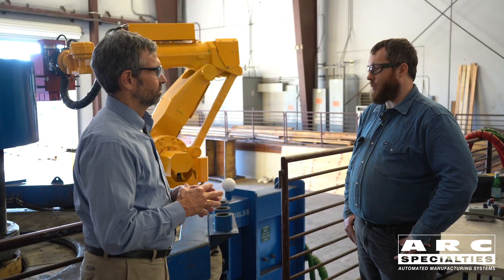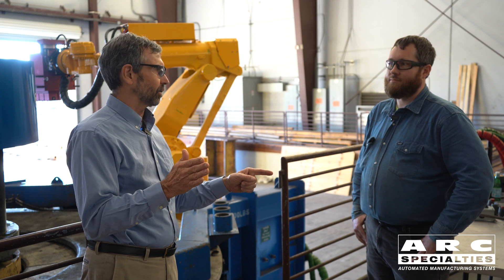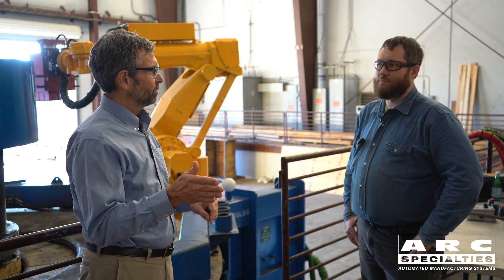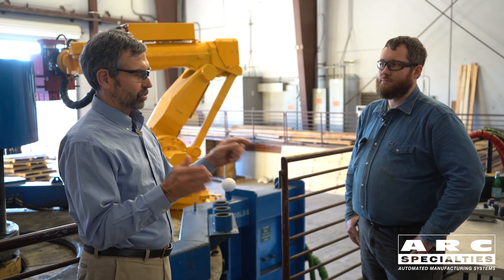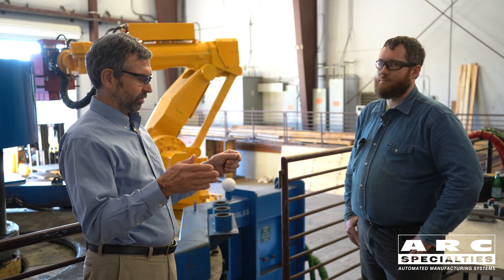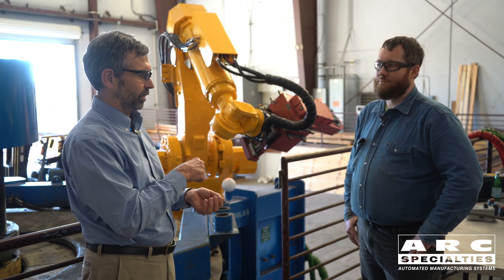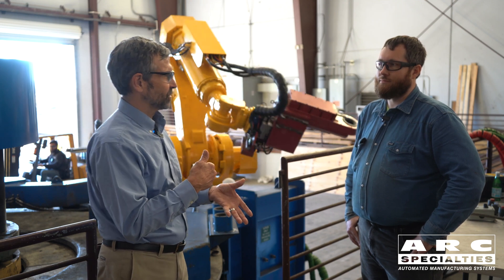In this situation, we laser the bolts and we laser the riser to find where everything is, and that's the point I wanted to make today. I've been in robotics since the early 80s. Way back in the day, to develop the TCP — the tool center point — the robot only knows where the end of its flange is, so you have to define the tool. That tool could be a mill, a welder, a painter, or in this case a wrench. We have to define the length and position of that tool relative to that last flange. If that's not accurate, the robot needs to know how many degrees to move to move this tool a specific dimension. So that tool center point definition is critical. We used to do it with the robot itself and a calculator, and it would take a couple hours. Then there's methods like the ABB bullseye where you're breaking a single laser beam and you can define a part — but that doesn't work on a complex system like this.